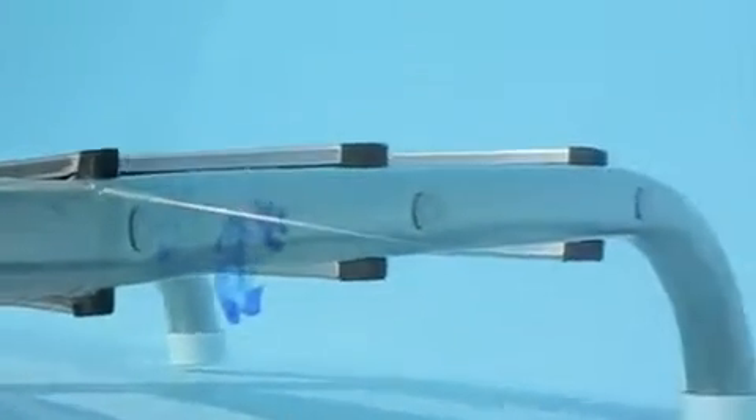Now when you do this, obviously turn off your filter — you don't want any unnecessary movement of the water. Here, for demonstration purposes, I dropped the dye into the skimmer area. As you can see, the dye gets pulled into the skimmer, and that's exactly what I was seeing when I put the dye by the pool light.